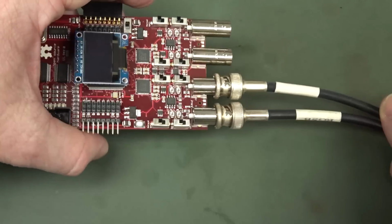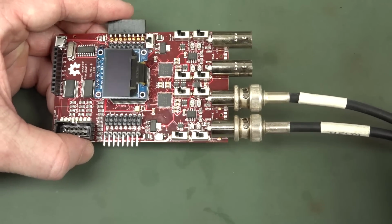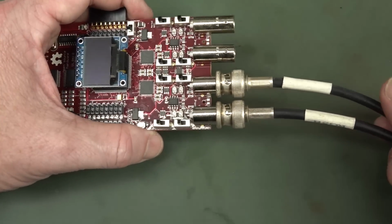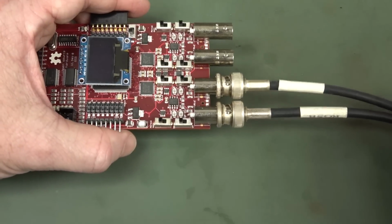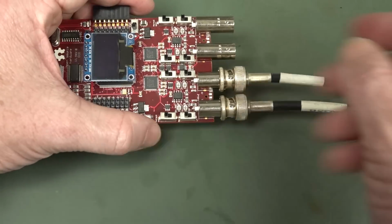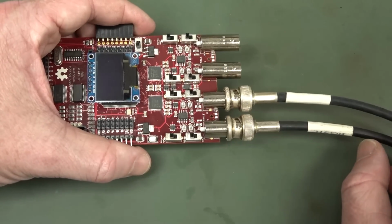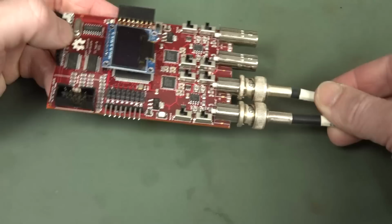So really, right there, it's claimed to be a proper oscilloscope. No, sorry, it's not. You've got to have the switchable ×10 probe capability, the lower capacitance to get the bandwidth required, and also considering the lack of input voltage ranges compared to a normal oscilloscope, you need the ×10 probe to get the higher voltages as well.